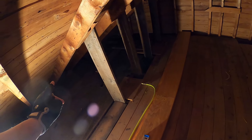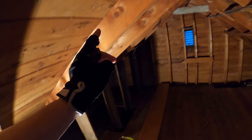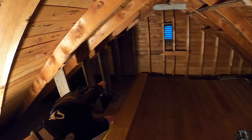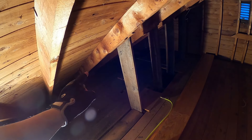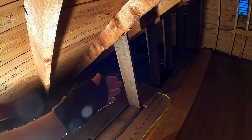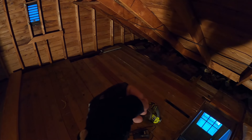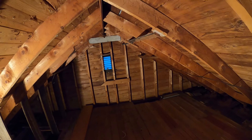Then you have your roof rafters that sit on top of the outside wall and come up here to a ridge. They are sandwiched right here. So to hold all this together, typically you put the ceiling joists and attach them to the roof rafters. That prevents the walls from bowing out. And then they're tied into that main wall or also the other ceiling joists that come over this way. In my case, they actually ran the ceiling joists all the way across, and that is what is holding the walls from bowing out — or going in, in some cases. But another thing that should be done is collar ties.